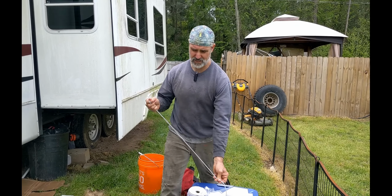The easy way to do this, maybe most of you have one of these cheap strippers. There are a couple different types of electrical stripper, but many of them have these holes right here. That's actually for cutting screws. Many of them you have to thread in, the better ones you have to thread into position. This is cheap. I don't know why I have this one actually, but you stick it in there and you cut it. And then I'm going to back it out and put a dab of red Loctite on, as I have with all of them. Just a dab.